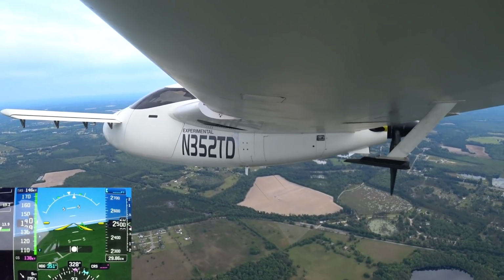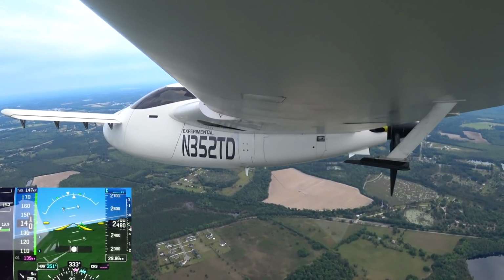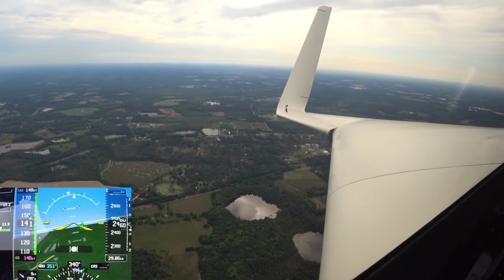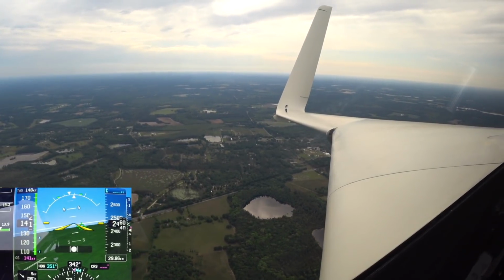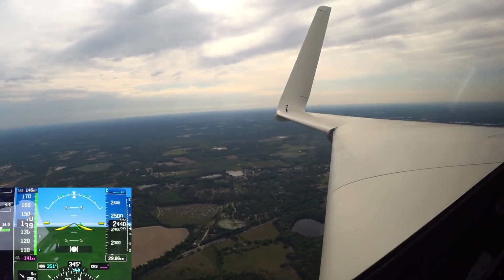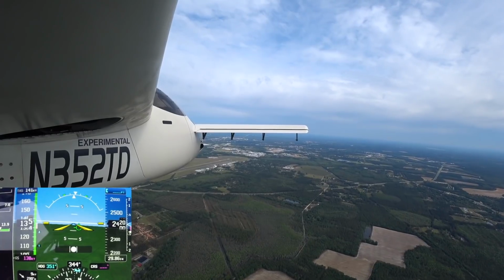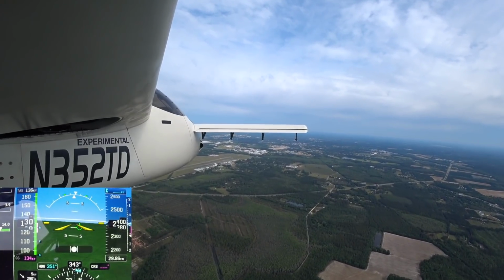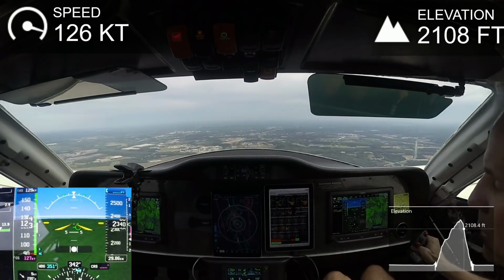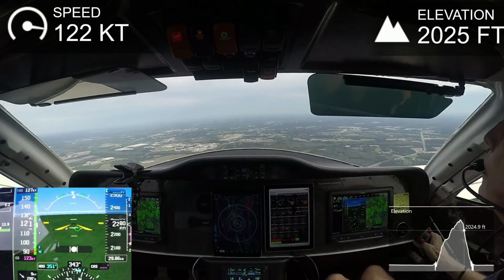And I guess the oil got to a certain temperature here that things started to change a little bit. I ended up getting the low oil light coming on, so I'd had that protocol in place in my mind for what I needed to do. So immediately pulled the power back somewhat and flattened the prop out, and called tower and asked them if I could just basically land on 17, which the wind wasn't favouring, but that's where I was. I was on a left base, or a left downwind for 17, and they basically cleared me to land there.